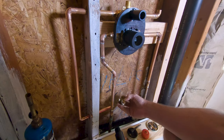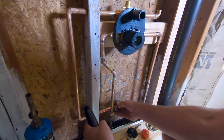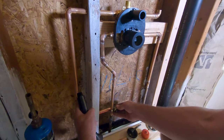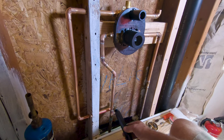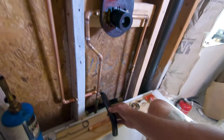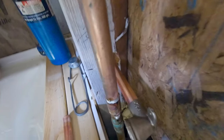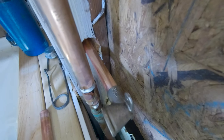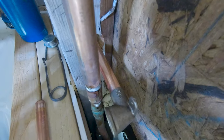I'm going to put in this piece right here, right directly on my line, facing 90 degrees out like this, so that I will leave a hole in the wall and this will screw directly in, and it looks like that'll kick about 2 inches in over the tub, which I like. There still is a gap between the two, so when I put this block right here in, I might have to manufacture a block, I'll probably just attach it right to the chipboard.